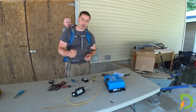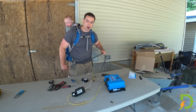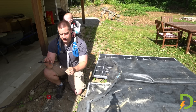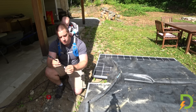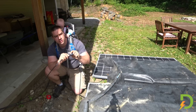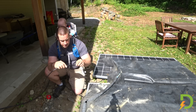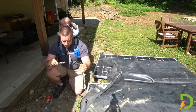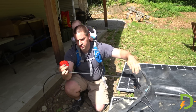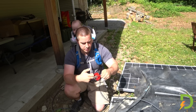I'm taking my PV wire with the MC4 connectors and I'm going to find the middle — in my case I am cutting it in the middle, but it depends on your situation. This is the positive wire coming off from the solar panel, and I'm going to connect it up to this one. That's slightly confusing because there's a printed negative symbol on this, but that's because I'm connecting the negative to positive. I'm now going to follow this wire down and put some red tape on this end so that I remember this is positive.